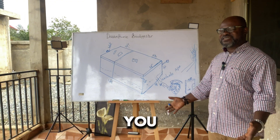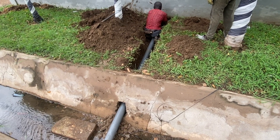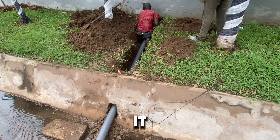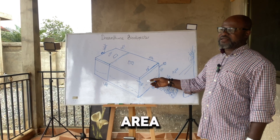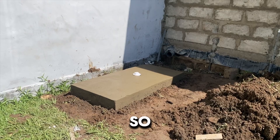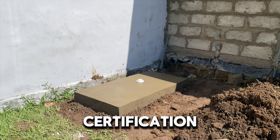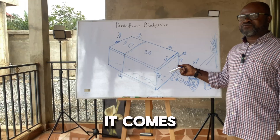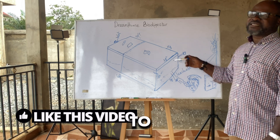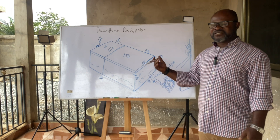The third option, which has also become very common, is the drainage system whereby the pipes from the digester are piped straight into the drainage system and the wastewater is taken away. Sometimes this is approved and sometimes not. In some local areas, the water in that drainage system is even worse than what is coming from your toilet. Commercial biodigesters in some parts of Ghana have been allowed and the EPA has given certification to put the water in the drainage system, but it comes with conditions — you must do a lot of treatment and the water must be tested to meet the EPA standard.